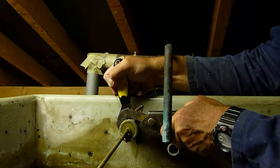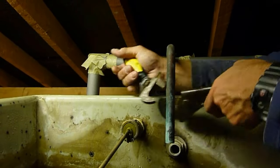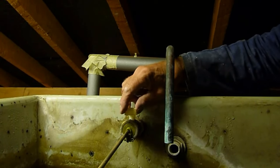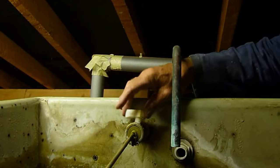Make sure it's nice and level now — get the ball cock dead right. That's it. Then put the spout back in — be careful not to cross-thread it, which is very easy to do.